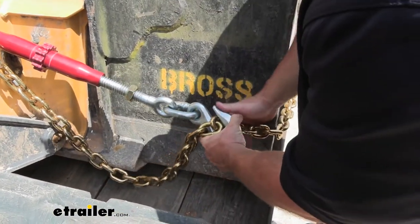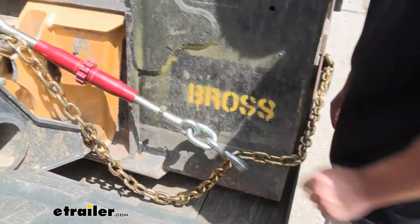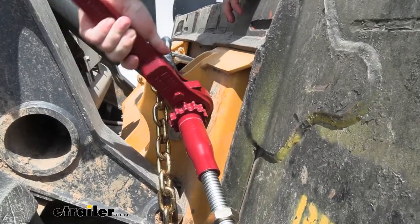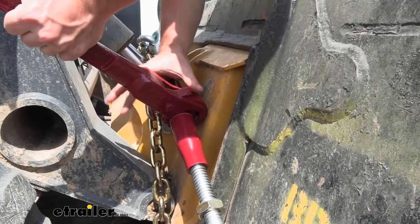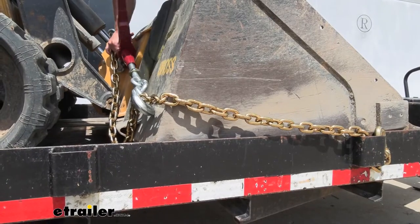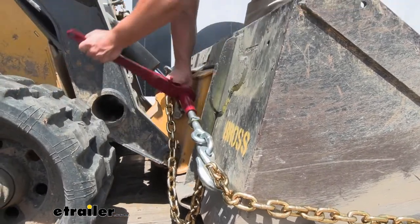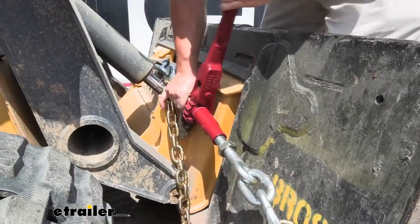It's going to be a little loose now — that's as tight as we can get it manually. But that's okay because I'm going to come back with the handle and start tying it down. It's going to pull from these two sections of the chains and pull them together, which will pull both sides tight. Much like before when we went to loosen it, except this time we're flipping the handle around in reverse. That brings the barrel up so I can slide into place, get the pawl engaged, and then I'm going to put one hand on the barrel and start ratcheting. You can see how it's pulling those two ends of the chains together — those hooks are slowly coming in towards the center towards the barrel. Once it gets going, it's getting tighter. They're starting to catch now — it's getting real tight.